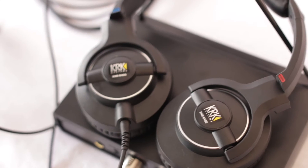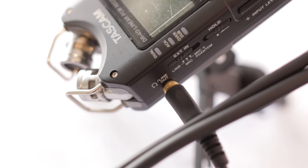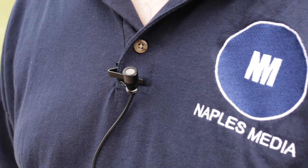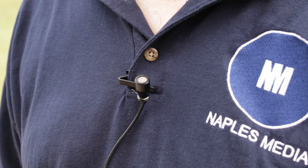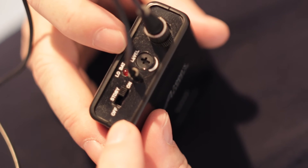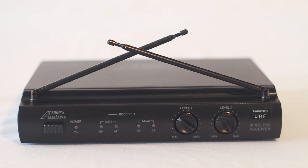Using a set of headphones, you can plug into your field recorder and monitor your recordings in real time. Always check for peaking. The lavalier mics have a windsock — leave this on at all times, even indoors. The windsock can struggle in high wind, so drop the mic's gain until this is reduced. To adjust each transmitter's gain, use the level settings on the main unit. Keep your transmitter units around 70% and only adjust as needed from the main unit.